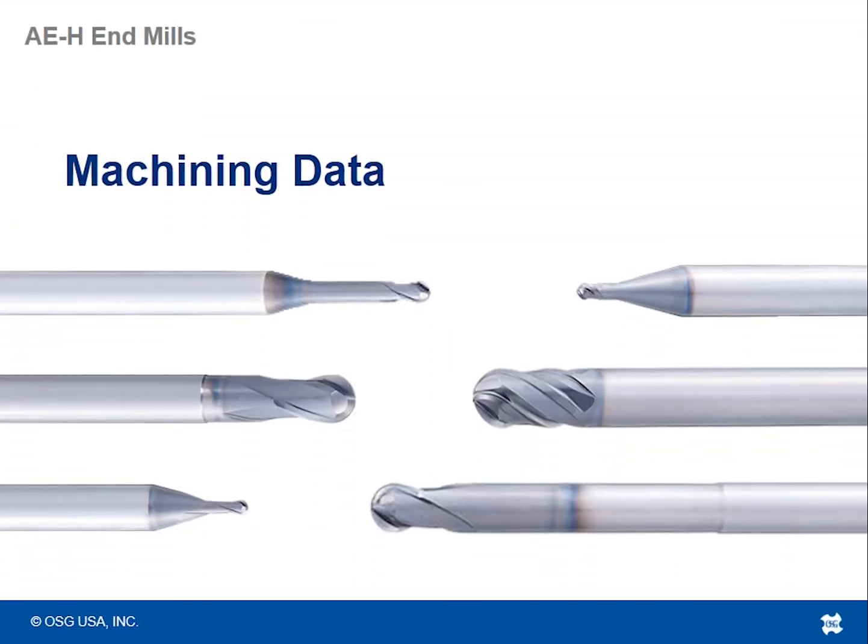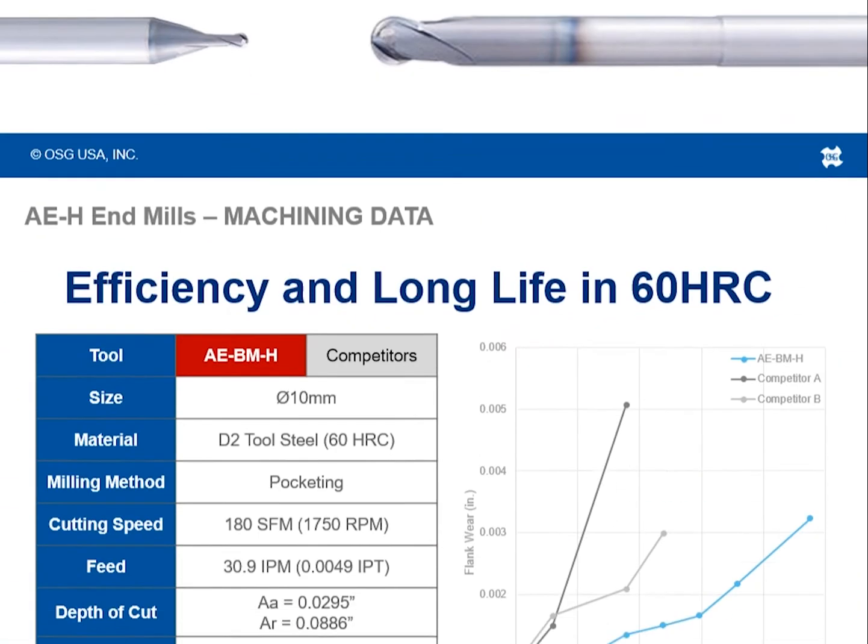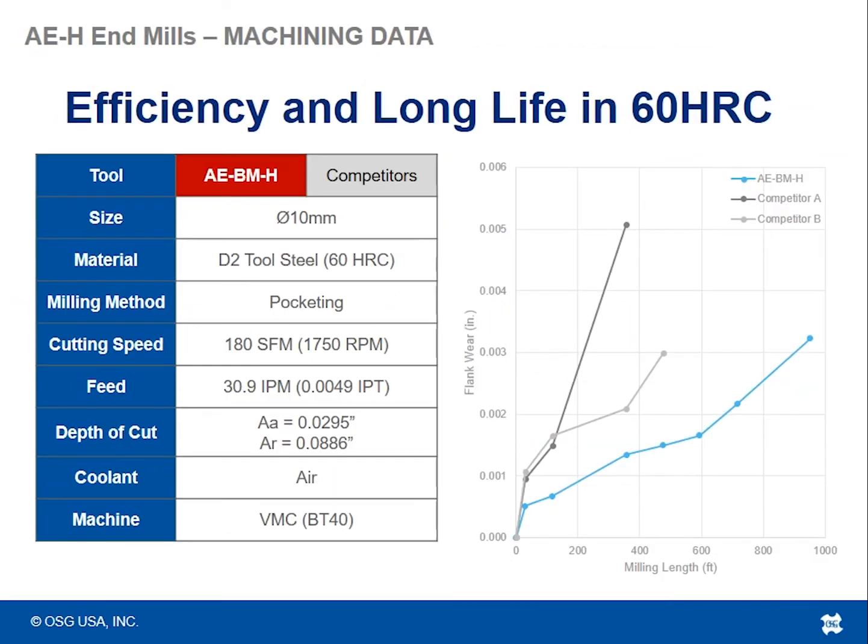So now we're going to go into a little bit of machining data, a couple of different data sets in various materials, and explain what we saw from those experiences. This piece of data is a 10 millimeter AEBMH, the multi-flute tool, against two competitors in D2 tool steel, 60 Rockwell. Here we were pocketing at 180 surface feet, about 31 inches a minute.